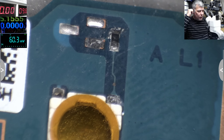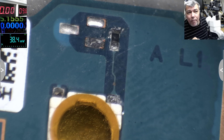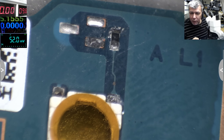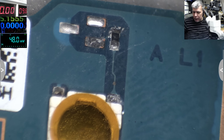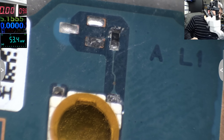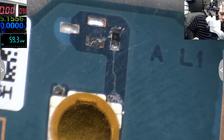Wait, wait - we are getting excited too soon. Because I understand the trace is interrupted. Let's wait for the solder iron and some rosin flux. Now I'm sure they put this resistor with some function here, but I don't know and I don't care - I don't want this resistor here. So we can modify the manufacturer's schematic - it's healthy to modify things. A lot to learn from this. So all what we need is a solder bridge. Keep in mind - bridge.